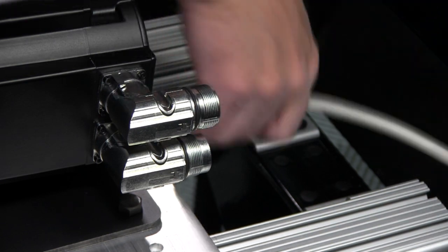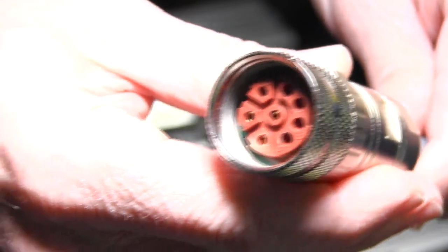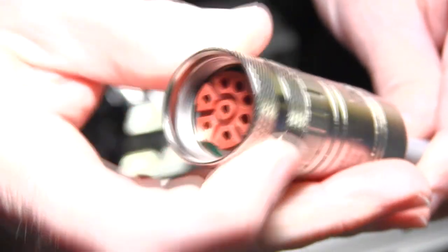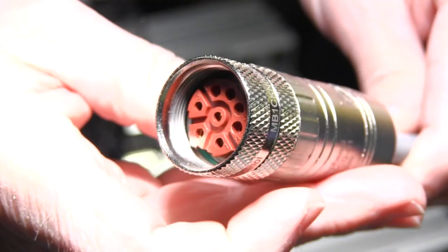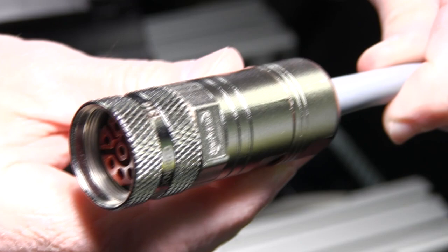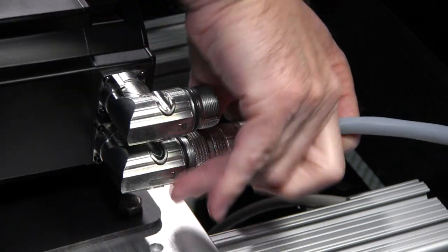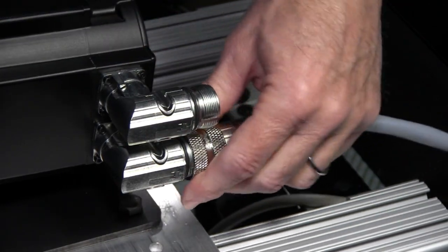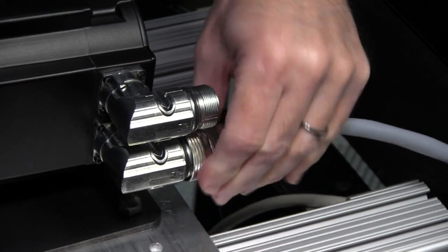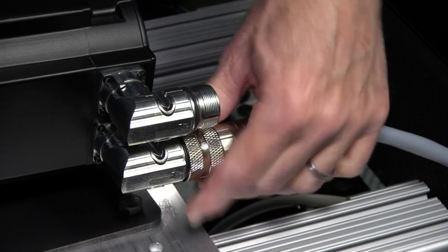On this cable — just to give you a quick close-up — this is the female cable, and on the box side with the control box they're all male. You can see there are threads inside and the ferrule, so it's just a matter of getting them lined up and putting them in. There's a marking on the side that needs to be vertical to the rig. As long as we keep that vertical it goes right on. These are nice industrial quality fittings made to keep dust and moisture out in the industrial environment where these servos typically operate.